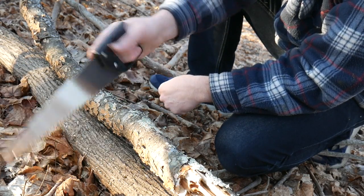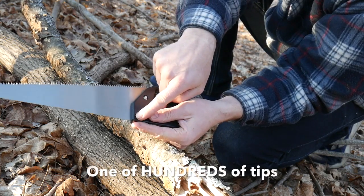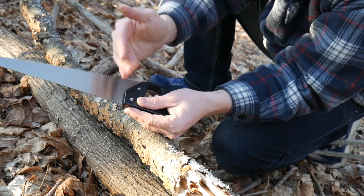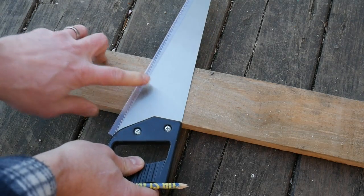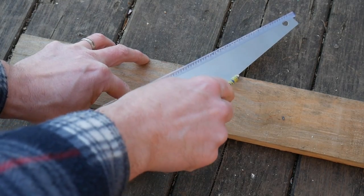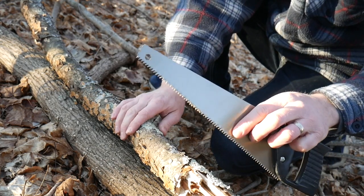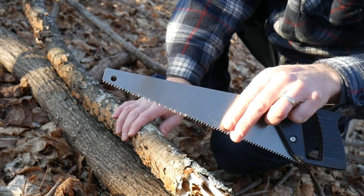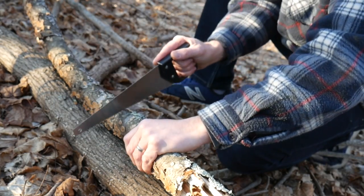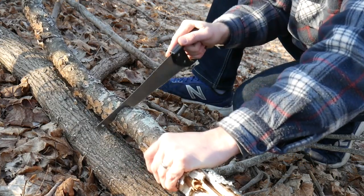A lot of people don't know that about hand saws. It also has — and this is something people don't realize, we talk about this in our hands-on workshop — some of the basics of tools. There's a stop right here and one here. When you ram this against a board, that becomes your 45-degree mark. When you ram it against a board this way and trace this off, that becomes 90 degrees. A lot of people don't realize that — it's your quick and easy 90 or 45, especially in off-grid building. It's built into the saw. Some saws have even designed that hanging point to open beer bottles. But it's already binding up, so I take that back.